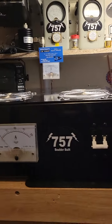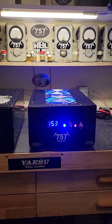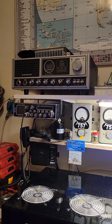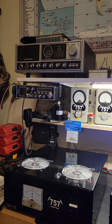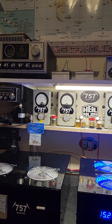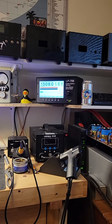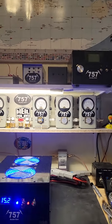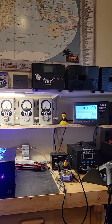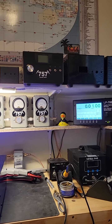We're going to go ahead and turn this on, and turn this one on. We'll look at the tune with the amp on. Audio — a little bit there, not much, less than about a quarter watt. We'll look over here and see what we're doing for wattage. You can see the Bird meters too — the first one's a reflect, second one is RMS average with a thousand watt slug, and the third one has a 2,500 watt slug in it, PEP.